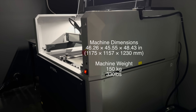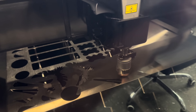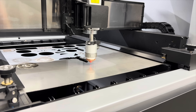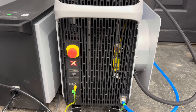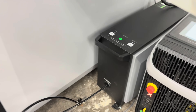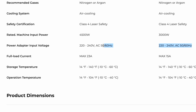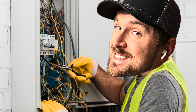It has an all-metal body which gives it a very industrial feel. There are two separate cameras — one for taking a wide shot of the whole work area and a second mounted to the gantry for close-up precision. The cut area has various options: you can put in slats for holding up your materials or hold them down with the built-in clamps. The X and Y gantries appear to be fully enclosed, which should make for an extremely durable and long-lasting machine. This is the 1200 watt unit, which has a fiber laser source and a separate wire feeder for welding. The smaller 800 watt has the laser source and wire feeder all in one unit, which might be better for someone planning on doing a lot of mobile welding. Either laser source will require a 240-volt outlet, just like you'd see on your clothes dryer or oven, so if you don't already have one in your workspace, call around to some electricians and be sure you know what that might cost to add.